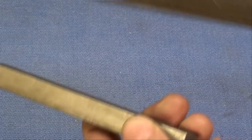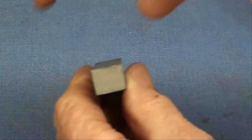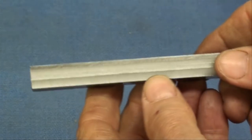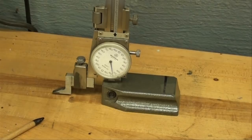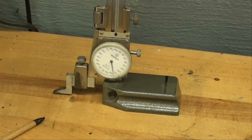The material is now down to rough size, and I have removed all of the milling burrs on all edges. It is now five hundred thousandths thick and six hundred thousandths in this dimension. If it helps you on a project like this, go ahead and put layout die on it, and you can with your height gauge make layout marks. But I'm going to do everything on the milling machine by touching the work and then feeding in with the dials the appropriate amount. So back to the Bridgeport.